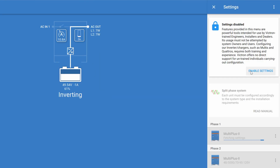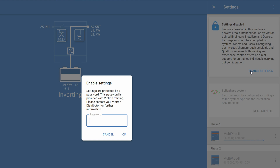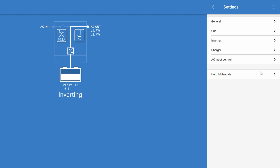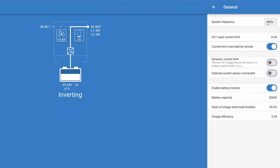Under settings, we'll click enable settings and enter the secret password, which is three Z's. Now I can see that both these inverters have been set up and we can go into the settings of each. You're going to enter the same settings in both independently, so write it down and do what you need to do to make sure you're entering the right settings into both inverters. The nice thing is these settings, as you make them, are sent to the inverter — so there's no need to separately send the settings after making them.